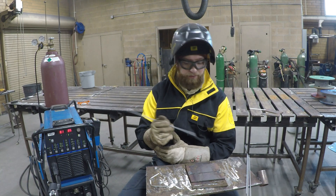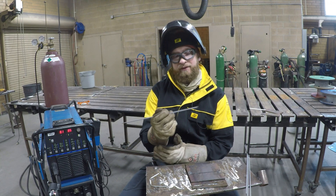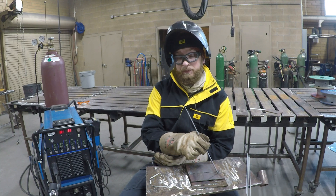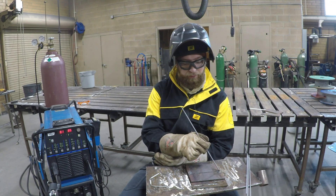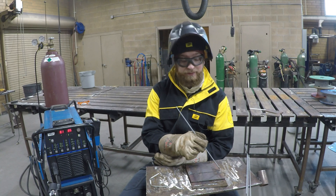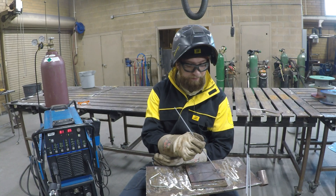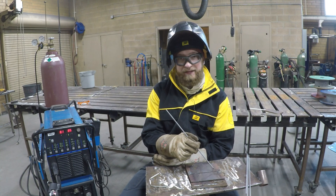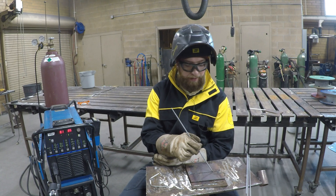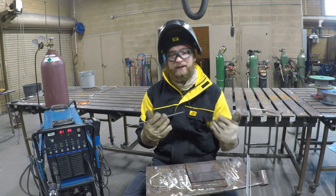The motion we're going to do today is a little interesting. I'm never really going to want to take my welding rod off the plate. 6010 has a very aggressive arc, so I can actually touch the metal and keep it there for quite some time and it won't stick. What I'm going to do is bury the electrode on the surface, get a molten puddle, push that puddle down and into the back of the joint, then whip forward a little, then push the next puddle down. It's kind of like a sewing motion — whipping out across the surface and then scooping back and pushing into the joint. It's really quick and fast. This is a hand-eye coordination skill we're going to build.